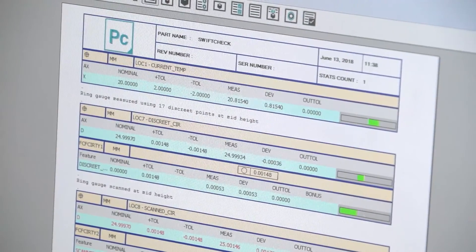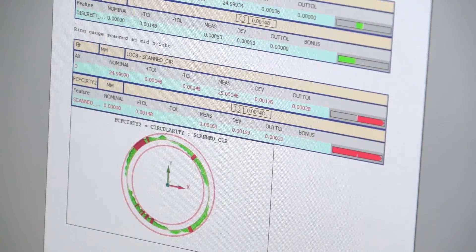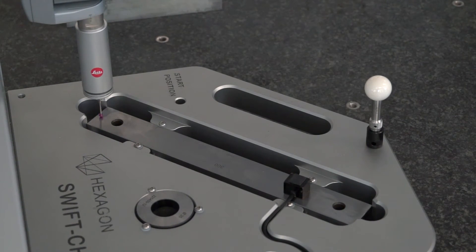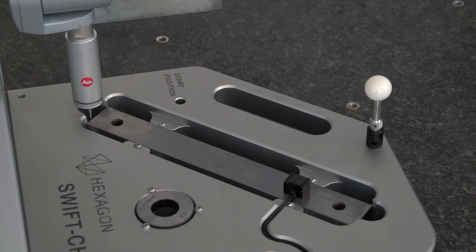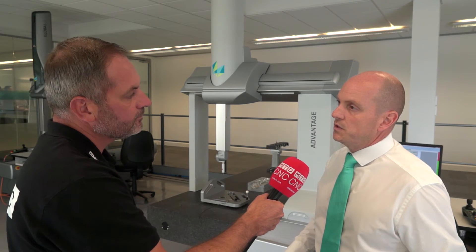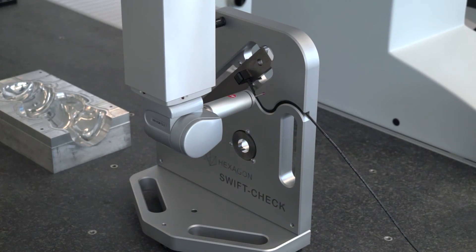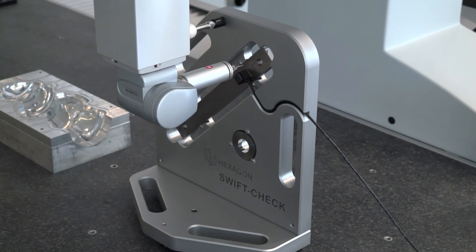For engineers, subcontractors, and OEMs with multiple CMMs measuring complex parts, Swift Check is something they really should consider. The idea is that it's simple by design and easy to use, with a fairly short cycle time so it doesn't significantly impact production downtime, while giving you confidence. If you are measuring complex parts, the Swift Check lets you measure the squareness of the machine and confirm it's still performing to its calibration result. For tight tolerances, you have confidence the machine is still measuring within the uncertainty of the range you're using it for.